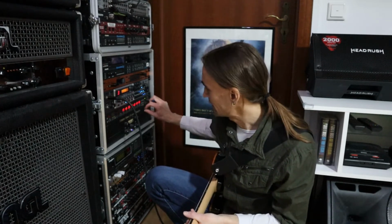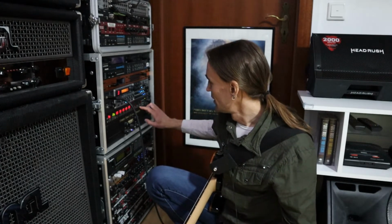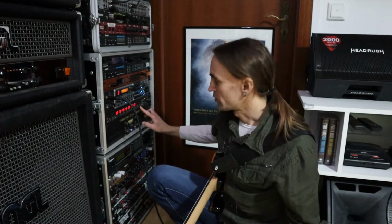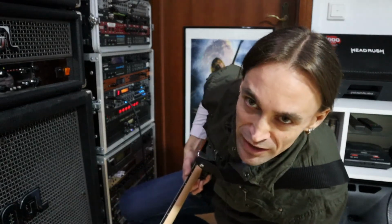Dynamic voice is something which has a built-in graphic EQ setting. You may know the Mesa Mark series amps, they have a 5-band graphic EQ, and they didn't have space here in the Triaxis to integrate this 5-band graphic EQ. So what they did is they took the famous settings of this graphic EQ, at least the most popular in my opinion, and they implemented it in the dynamic voice here. The higher you set it, the more of a V shape is coming into the picture. And here the 3.0 is not a very high dynamic voice.